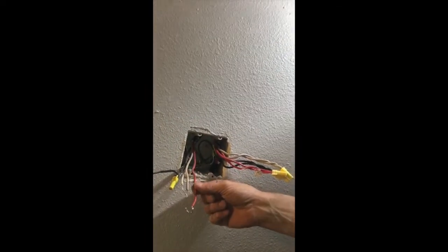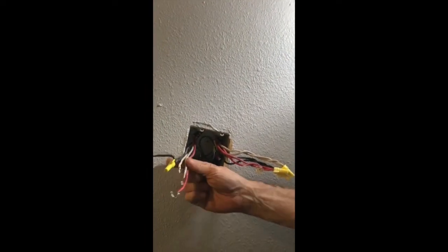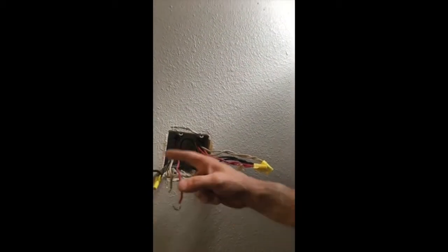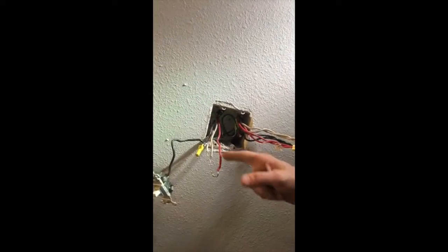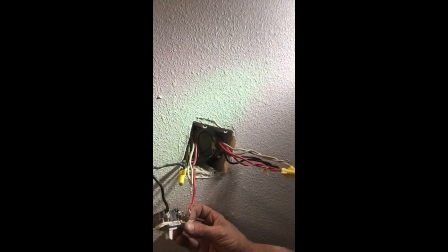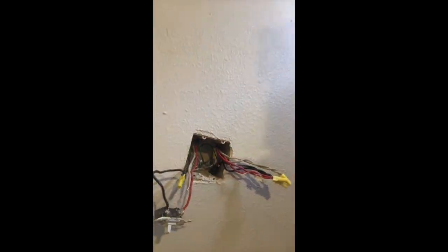This was a switch leg and a power. These are two separate. This is a dead end three-way that was moved years ago with aluminum. But this right here is your switch leg, your power, and your neutrals tied together. So I could light up this room and show you this. Carefully. There you go.